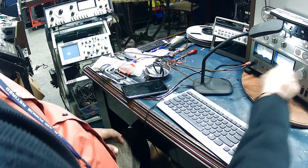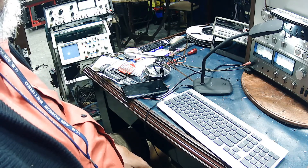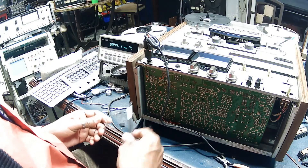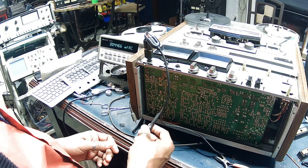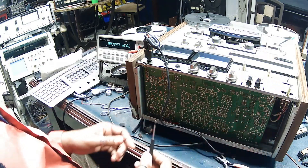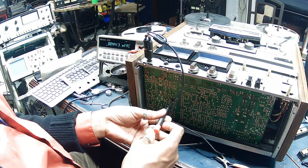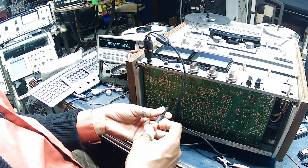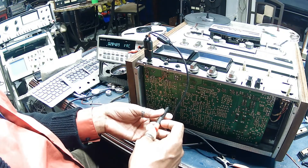That tells me that the playback head is in good alignment. Next is the output level calibration. VR104 and VR304 are just the left and the right channels. I've already done the left channel; now I have the right channel connected to the multimeter. We're going to look for .44 volts at the output when I play the reference section of the tape back. This is going to be the right channel and we're looking for .44 volts. 1 kilohertz at reference level — set reproducer gain so the volume indicators read 0 decibels.